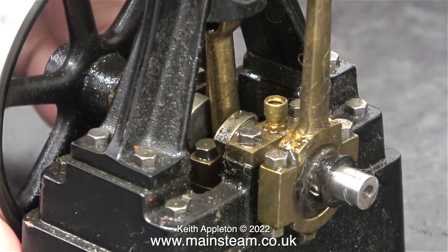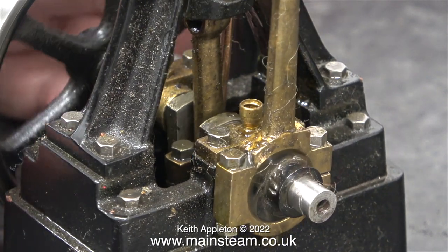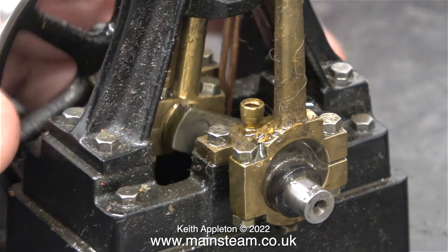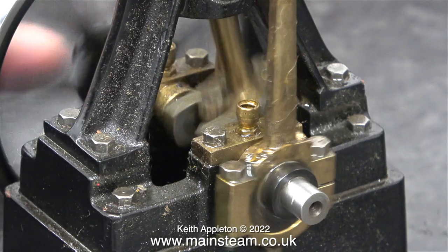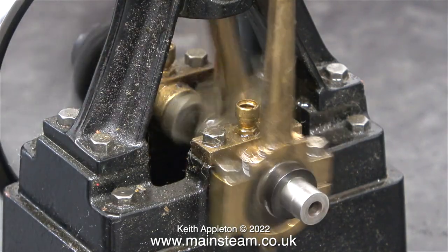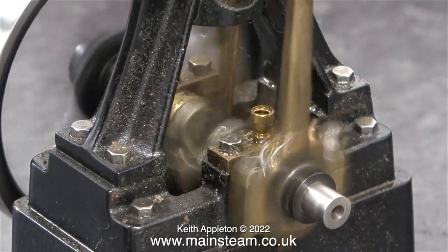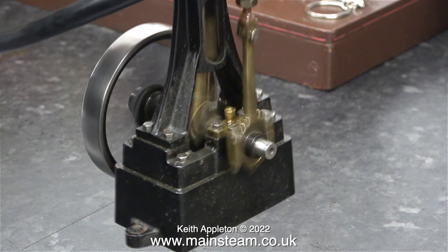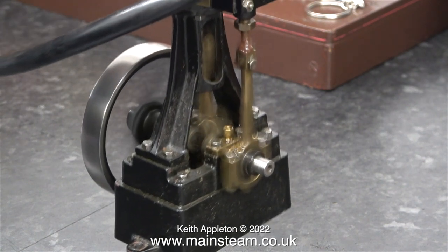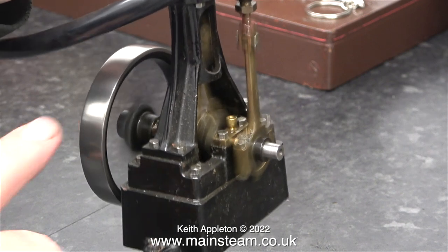I'm rerunning this clip in slow motion, and as you can hear, the air has been admitted just before top dead centre at both ends of the stroke. The slide valve is still blowing. I will sort that out in the fullness of time. The running qualities of the engine are transformed, and now there is plenty of power. And there'll be even more when the slide valve moves correctly.